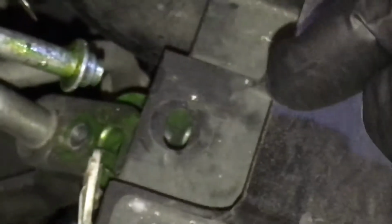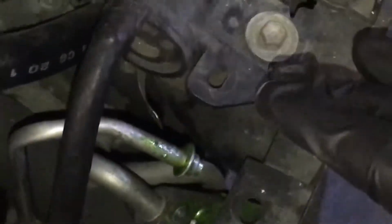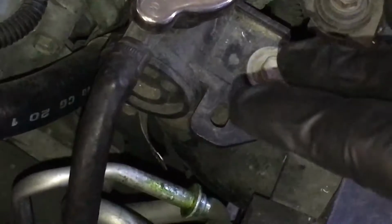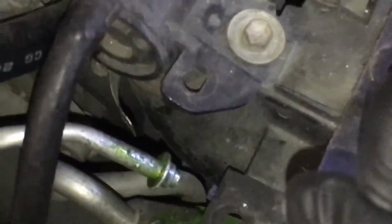It didn't leak under vacuum, and it didn't leak under nitrogen pressure, and it did not leak under refrigerant pressure with hot gas. It leaked after cooling off, and once the pressure was falling and the lines were contracting, then it leaked. And it leaked all the refrigerant down to 0 psi.